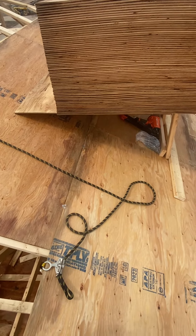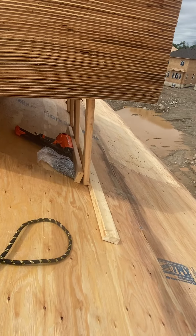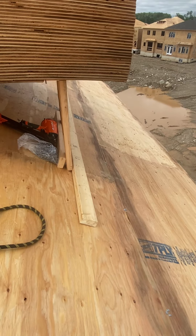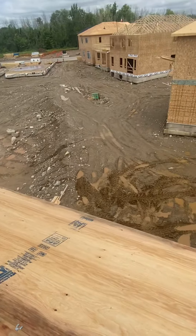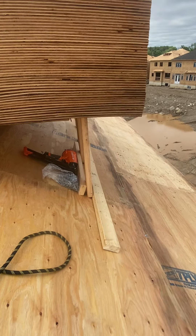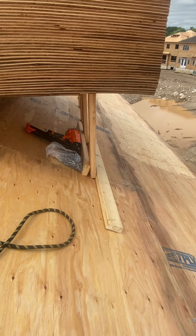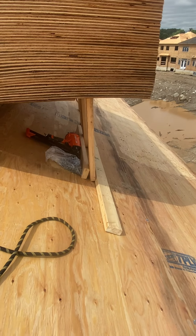I'm just about to take lunch, so I just wanted to get my phone and illustrate how I feel about this. I always put a kicker board right through — something about at least 10 to 12 feet — and I'll show you why in a second. You nail it. You position it, obviously, as high as you can, but high enough that your machine can reach it. I nail one and I measure off the sheet so it's equal measurements, and then I just make sure you hit the jacks, the trusses, otherwise it's really not doing anything.